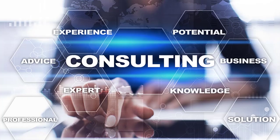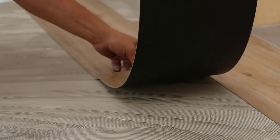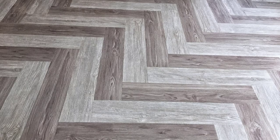And as always, you're going to want to consult with a Resilient Adhesive Manufacturer for confirmation that their products are compatible with cold, liquid-applied, latex-based membranes such as the ones we highlighted in this video. But as long as you're using a non-solvent-based, water-based latex adhesive, or you decide to take the route of skimming these membranes with a thin skim coat of the polymer-fortified thinset mortars that we mentioned, you will likely have beautiful and successful Resilient Flooring installations over our LATICRETE liquid-applied waterproofing and anti-fracture membranes for years to come. I hope this video was helpful, and thank you for choosing LATICRETE.